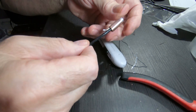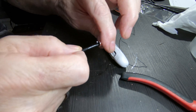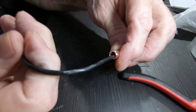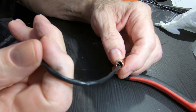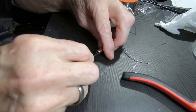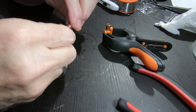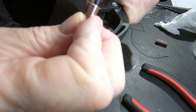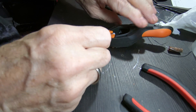Before I do that, I'm going to tin this little piece of pipe on the inside and solder it right there — see where that wire pokes out? Just solder it right there. Then I'm going to pull it through; it'll crumple up a little bit, that's fine. I'm going to solder the ground to this case, and that's our ground connection, our case connection. Be careful not to clamp the microphone — just clamp the piece you're going to solder.